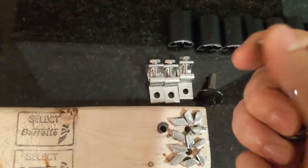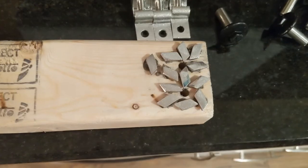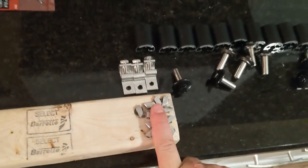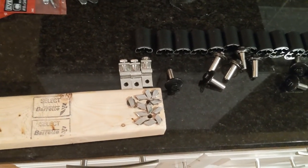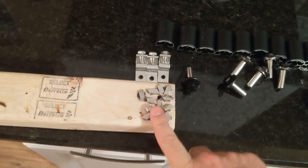As you can see here, I drilled 12 holes, and they screw off. I pushed them down in, and that allowed me to sand very evenly with a hand sander. If you don't have a bench grinder, you can sand it, but it will take a lot of sandpaper and a lot of time, probably over an hour, hour and a half of actual sanding. So bench grind it first, halfway down, then sand it to make it perfectly flat.